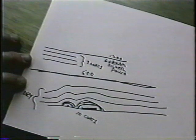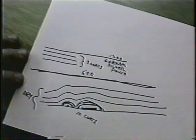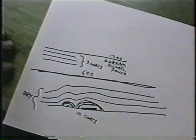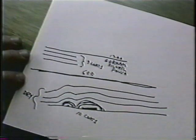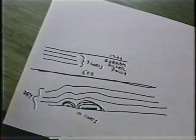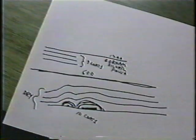Now, if you go back and look at this, there's a lot of little tips and tricks, things that'll make your life easier. One of them, the biggest single thing you'll notice, is dope is a pain to sand. If you try to sand silver dope before it's dry... whenever you spray silver, try to let it dry a week instead of a day. That'll make it easier to sand. Anytime you're going to sand silver, let it dry extra days.